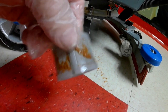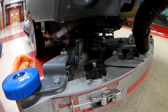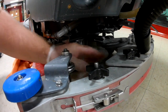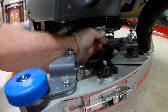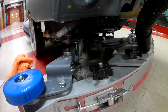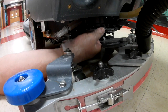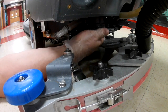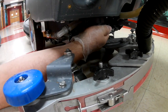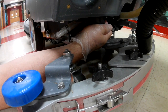Let's take it, clean it, and put it back on. I just cleaned that thing with just tap water — all you're doing is washing debris out of it. Put your filter back in and put it back on. Probably would have been easier if I'd done this when I had my squeegee off. How often do you need to do this? I would say once a month at least — it really depends on your water source and what you have in your water.